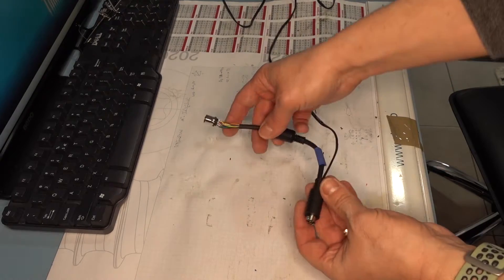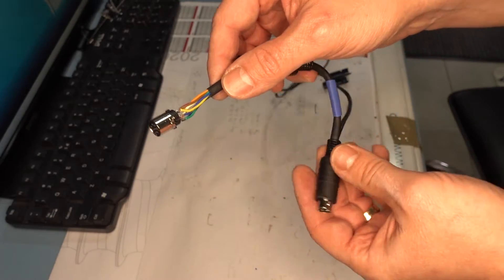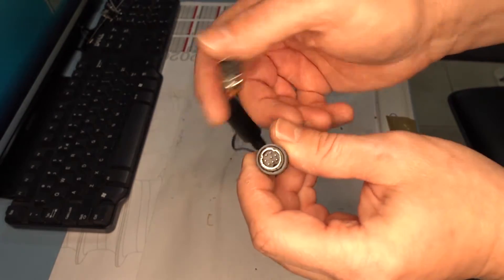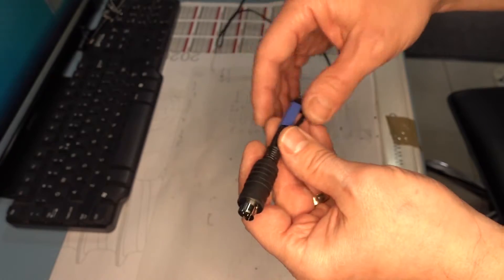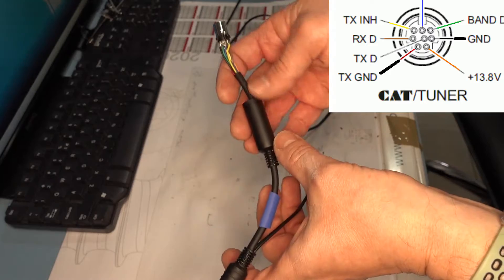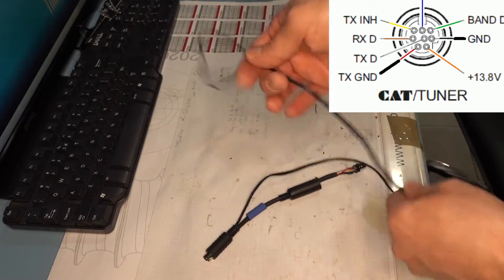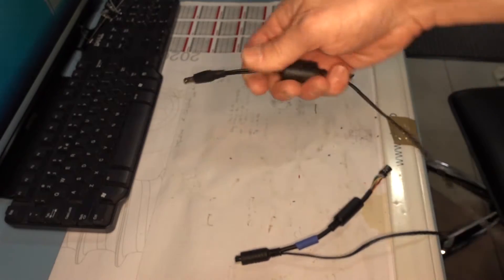This is the extension cable I made. It was hard to solder so many wires into such a small connector. Not all the wires are required, but I did them all anyway. A male and female connector — and according to the diagram, the TX and ground wires are passed through to the other connector but also split into this cable, which ends in a barrel jack that goes into the antenna switch.